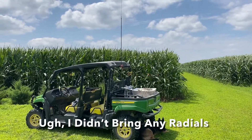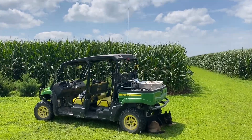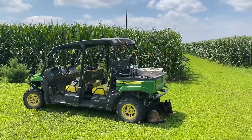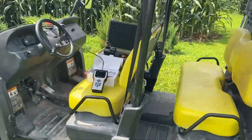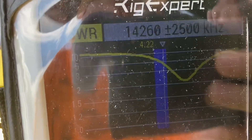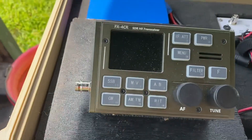The dog and I decided to just quick pack up a radio and come out with a hamstick on the gator. Looking at the SWR on the Rig Expert, it sucks — for 20 meters it's way out of whack, and I'm running the FX4CR today which is not going to handle it, so we've got to get that down.